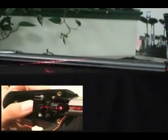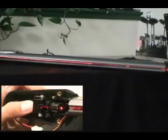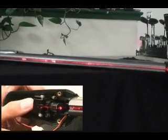Once all required screws are loosened, you will be able to move the laser line manually. Adjust the laser line with your fingers to be parallel with the red lens. If needed, adjust the yellow screws to have the laser line on the red lens.